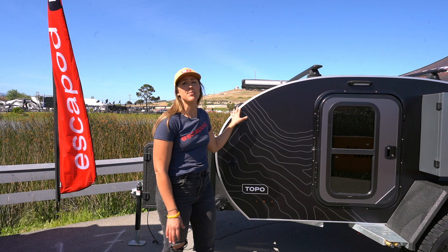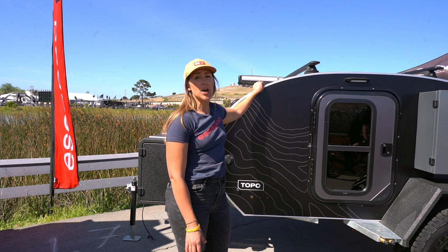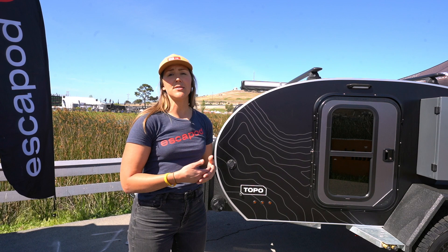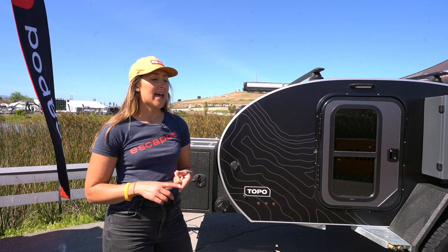All of that is brought together with our trim along the edges. We have a triple redundant waterproofing process using butyl waterproof tape, layers of aluminum trim, silicone along the edges, and weather stripping that goes inside the trim itself. All of this sits atop a 2x2 steel frame that we bring down to Salt Lake to have galvanized.